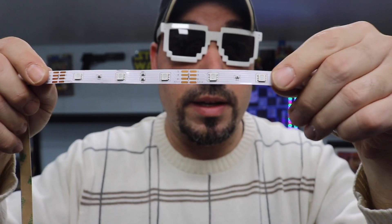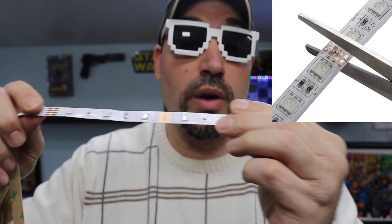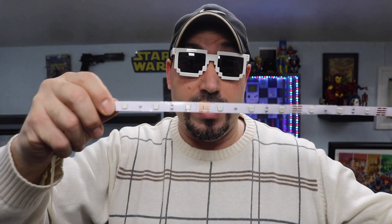How do you know where to cut? Well, these LED light strips give you where to cut. There is a little indicator right here — that's where you can cut. This is also where we're going to be making our solder joints for this light strip. There are connectors you can buy. If you saw my desk setup video, I used the connectors, but I didn't have very good luck with them, so I decided just to solder these. Basically what I did was I put the power supply down here because it would hit that shelf and this shelf, and then from this shelf I'm going to go up along my light box and put a light strip in the back of the light box. I also want to put a little light strip on the back of that as well. I just ran this across the shelf where it landed with the scissor cut on the edge.